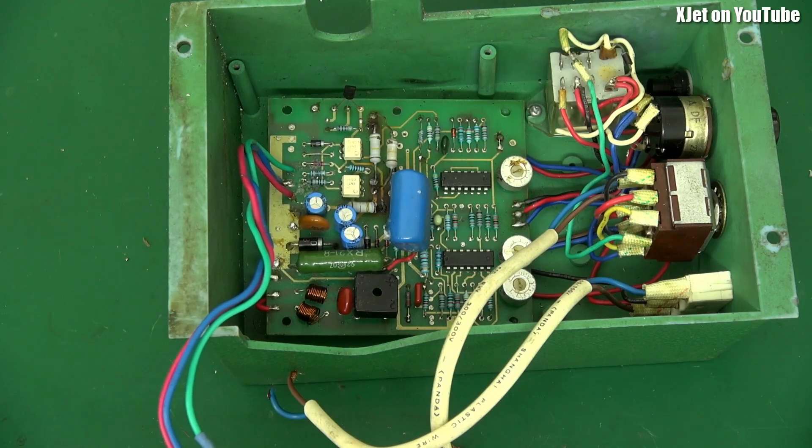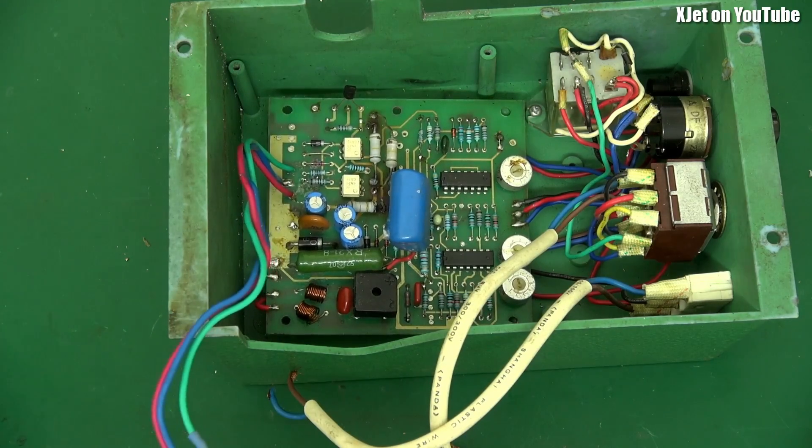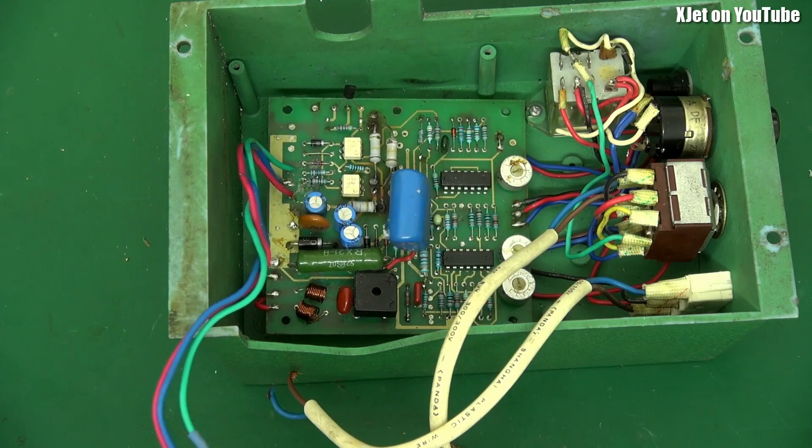At the moment, this board has this big fat resistor, and the way it works is you turn the knob until you get a certain speed. As you apply load to the lathe and start cutting metal, the motor naturally tends to slow down, which means it draws more current and more voltage appears across this resistor. That is fed back into the circuit to increase power to the motor — so it has a feedback loop that tries to keep the motor at stable RPMs regardless of load. It works reasonably well, it still slows down a bit. But I'm thinking — I might put an optical feedback tachometer on the motor shaft, actually measuring the RPMs directly.